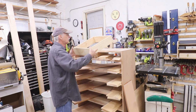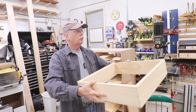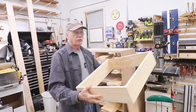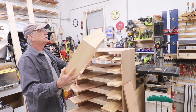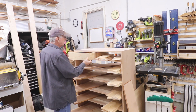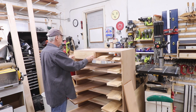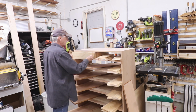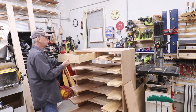Anyhow, in the short, I demonstrated this. I built a prototype drawer assembly from plain old pine, dovetailed to both ends. I've changed my mind about the rear. It's not going to be dovetailed. It'll be a rabbet joint. Then I test fit to make sure that my sizes are correct, that everything is copacetic, and it slides nicely and it doesn't rack. So that worked, and that's ready to go.